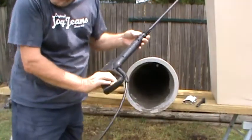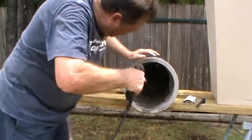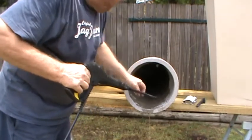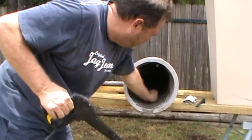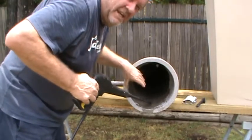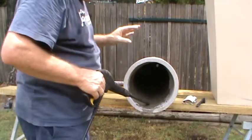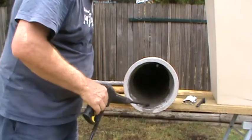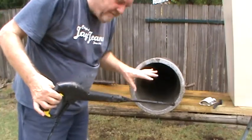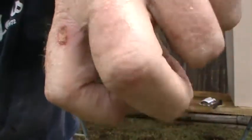Now the trusty old water pressure cleaner. All we're trying to do is just get rid of any loose material in there, especially leftover material from your brushes or anything else that might get stuck in your waterproofing, and to give the waterproofing the best chance to stick. Because it's so important — you put one coat on, after it's dry a second coat, then keep your hands away or wear gloves because this will take some skin off your hand. That happened to me a few days ago when I was distracted.